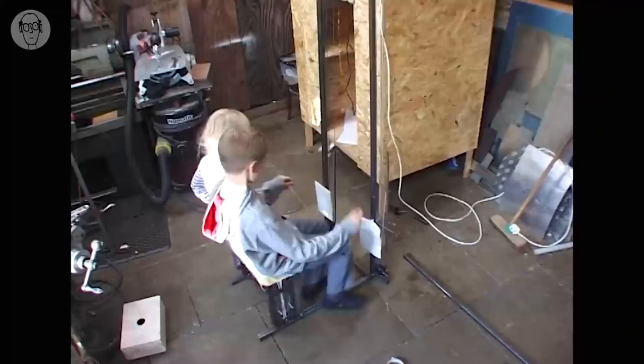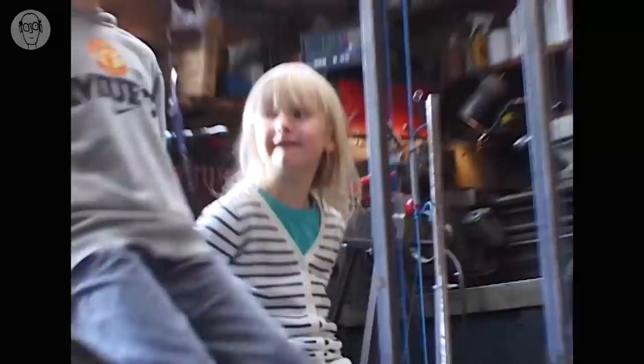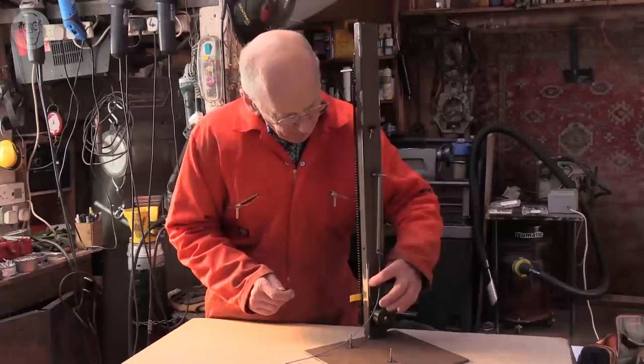When I was starting pirate practice, I obviously had to connect the bouncing motion to make the boats go up. Well, on this very rough first prototype, I hadn't made any boats, so it's just bits of paper going up. But very early on, I found that I could do it with capstans. I'd never used a capstan before, but I've made this model to show roughly how it worked. So it has a spring, and then the cord wraps around the capstan a few times.